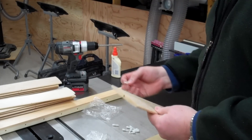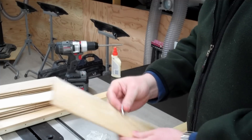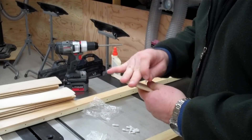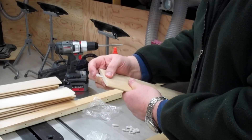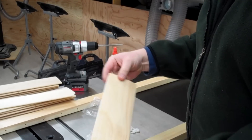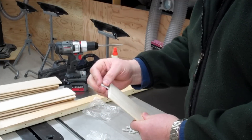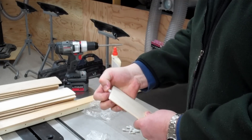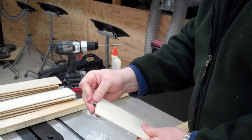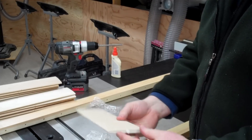Now the next step is to put these little pins into all the louvers so that the louvers can actually operate. We've got the holes that we pre-drilled. This pin just slides into that hole and fits up snug against it, and you just keep repeating that for each one of the louvers until you've got all the pins in. Then those pins will fit into the holes that we previously drilled into the stiles.